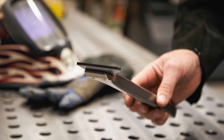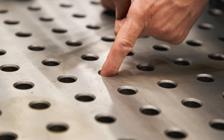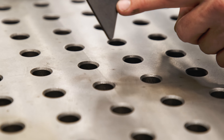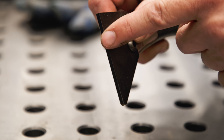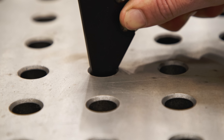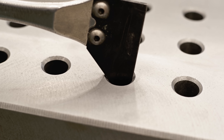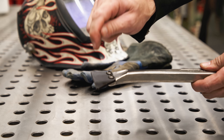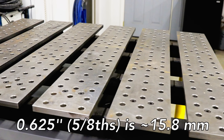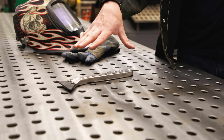You're going to be using this tool a lot. The 45-degree edge — if there's weld spatter on the chamfer or inside of the bore of the hole, you're able to take this tool and lay it sideways. This back edge will cut the chamfer, this leading edge will cut the bore. So you can scrape the spatter out and not damage the hole. Don't run a drill through there — don't do any of that. This tool is designed to take care of you. Even if you have a 5/8 table or a system 28 table, get one of these. It'll help you with table maintenance.